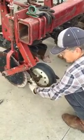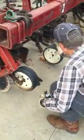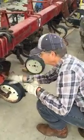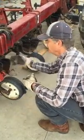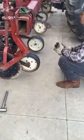When it wedges up against here, there's no place for it to go, and this has friction, and it'll stop it. Where if this wheel was over there, where the rubber is turning on the outside of this, then it won't. Now, if you have problems with it plugging on this side, then this is the wheel you want on there, because the wheel is turning on the place it plugs. Helps keep it cleaned out. That was a very good question. We need to cover that.